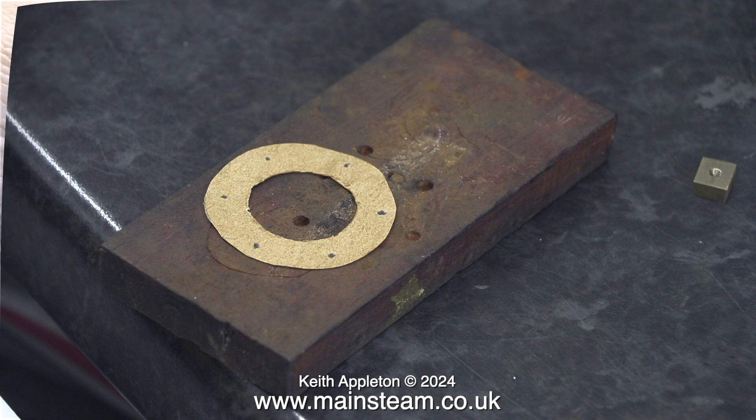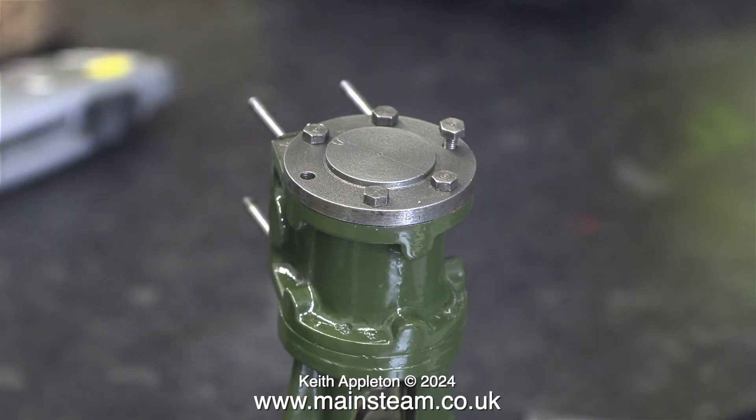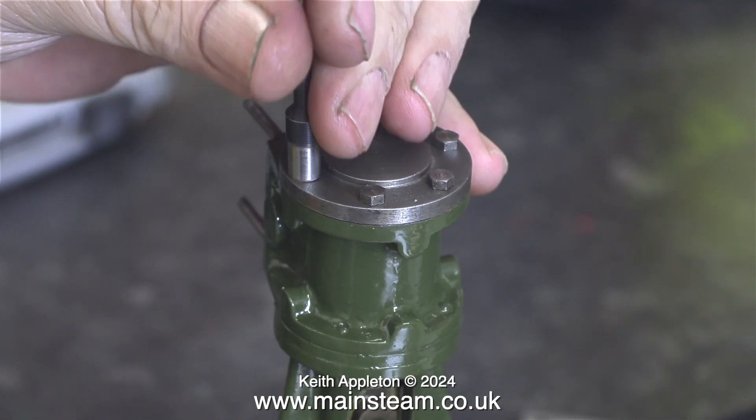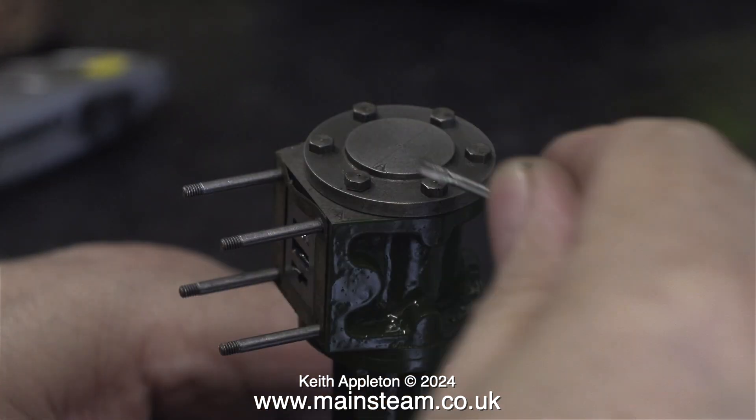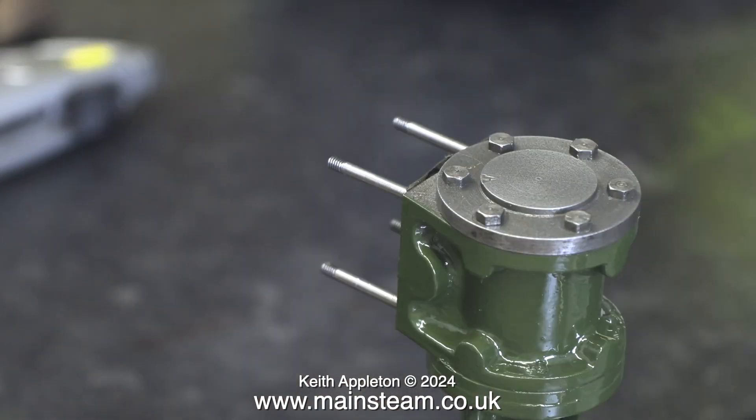Although using a scriber is a method I use frequently. I haven't shown the drilling of the gasket — it's quite straightforward. Here I'm showing the fitting of the top cylinder cover in place. I'm being very careful with the cylinder head bolts. One of the holes in the top of the cylinder has been damaged by a previous over-tightening of the bolts. I was very gentle with that one; the other five bolt holes were fine. I tightened the entire assembly including the gasket onto the cylinder.